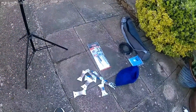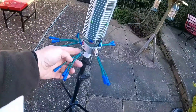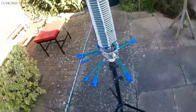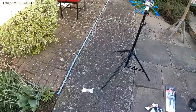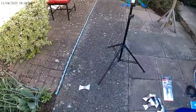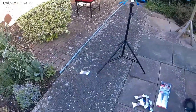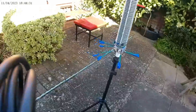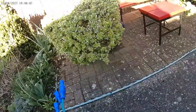The ground radials are five metres long, just bits of plastic, and they all connect in here using car electrical connectors. That goes in there. They're five metres in length — that's a quarter wave on 14 MHz. Then there's the cable which goes into the socket in here, like any SO239, with a right-angle adapter so the cable doesn't flop down.